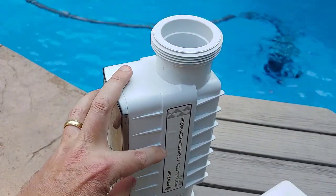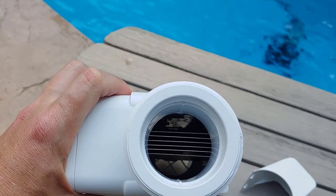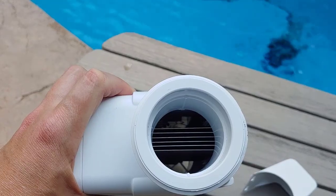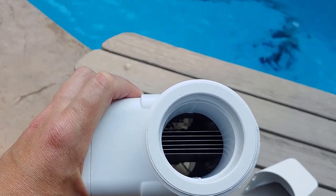Once that cap's on, you'll pour about 50 percent water down into that hole and then finish it up with muriatic acid. You need to have a mask on, or plenty of ventilation, or both, and then add about 50 percent muriatic acid.